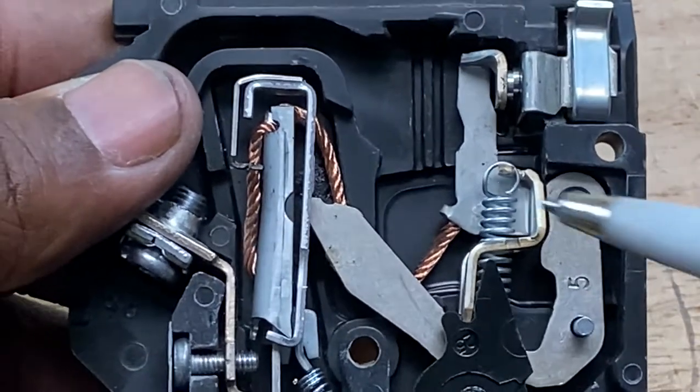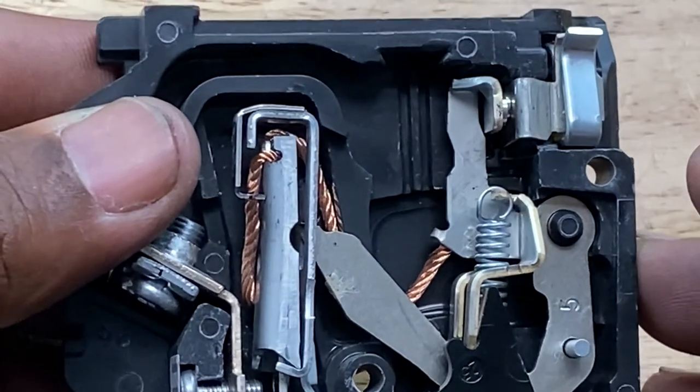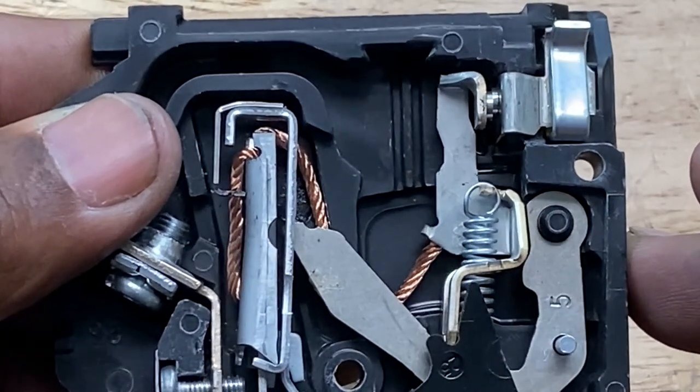The electromagnetic portion of the breaker handles very high levels of current, mainly short circuits. In the circuit breaker world, you have a variety: arc-fault circuit interrupters, ground-fault circuit interrupters (GFCIs), single-pole breakers, and double-pole breakers. We're going to talk about all of that in upcoming videos. But if you got the basics of how a circuit breaker works in today's video, hit that like and subscribe button, don't forget to share it, and I'll see you guys in the next one.